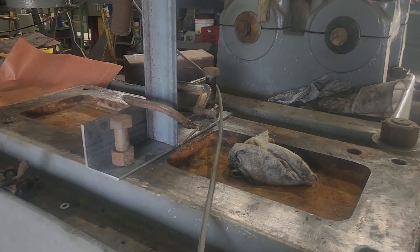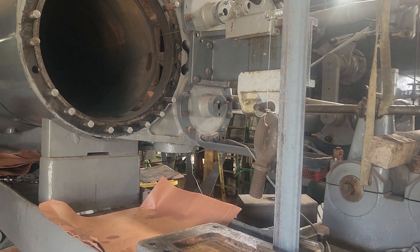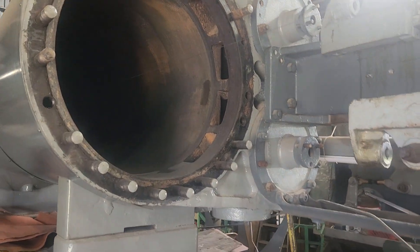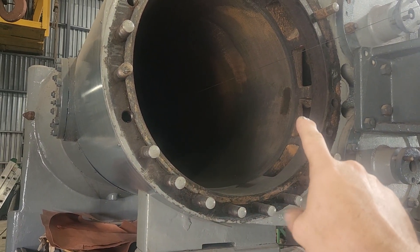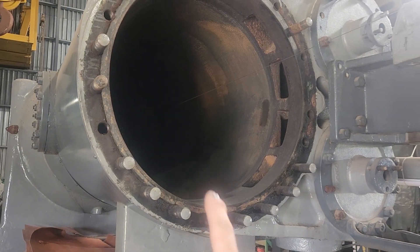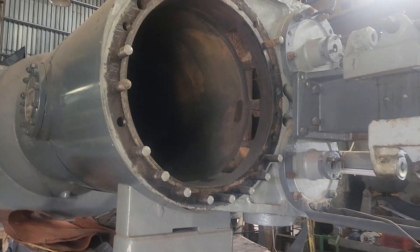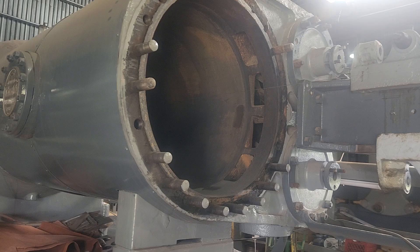It's just clamped in place for now — I'm actually going to weld that here in a little bit when I go to do the final measurements. What I have to do at this end is go in and measure the bore diameter with my inside micrometers, then go half that distance and see where that wire is. I've got it lined up pretty close right now.